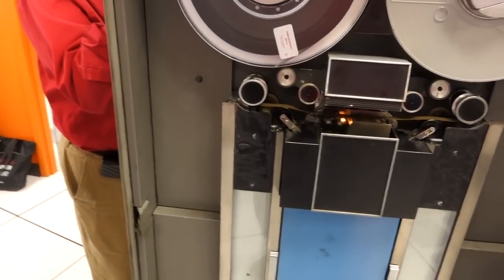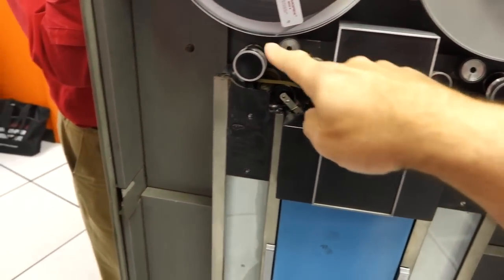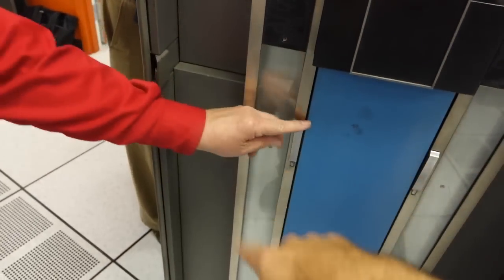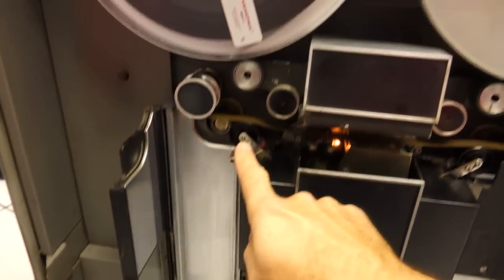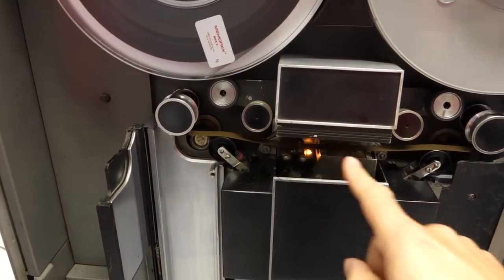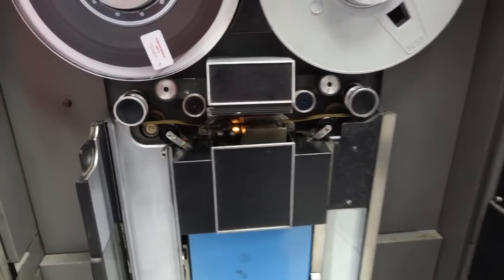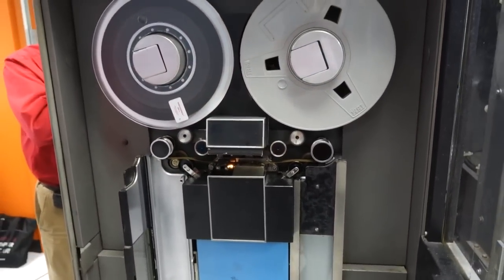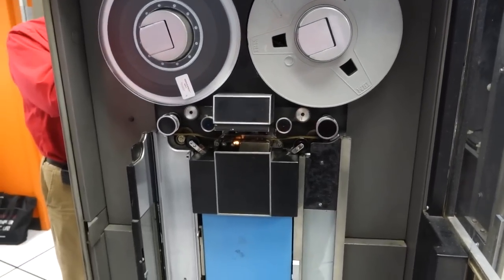the way it works is that instead of going directly under the read head, the tape first is sucked in by vacuum in this vacuum column right here that Carl just opened for us, and then it allows the tape to coil into a reservoir here, and the capstan can pull on it very, very fast. It can start and stop so fast that it can just read one record at a time. And of course that's done so this can be operated like disk drives, which didn't exist at the time.